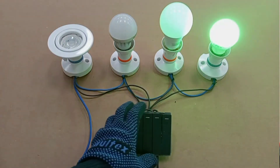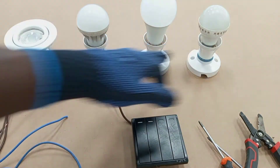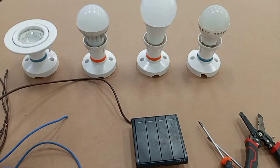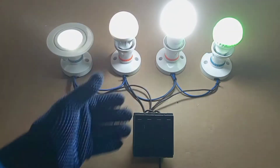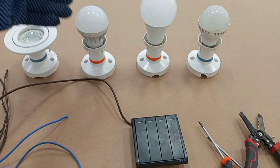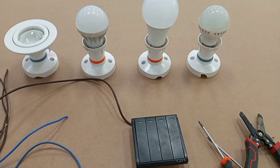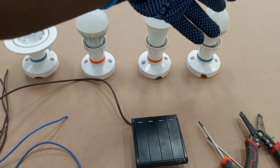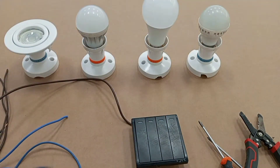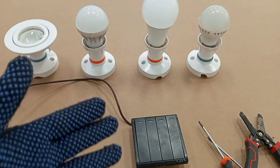Multi-gang switches are usually two-way switches. These could be four different lamps in a particular area — a hall or a sitting room. These lamps are different: there's a spotlight, another lamp with lower brightness, a similar one that is colored. So you may want the place to be colorful and only turn on the colored lamp. These are four different lamps that may be used separately. If all these lamps are in the same area and you can conveniently control all of them from a single point, then you will need a four-gang switch.